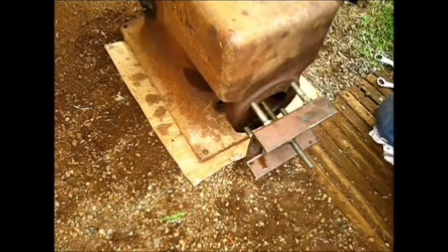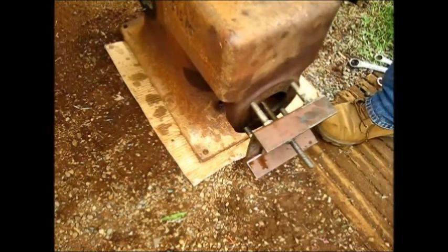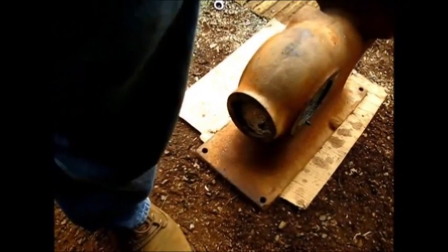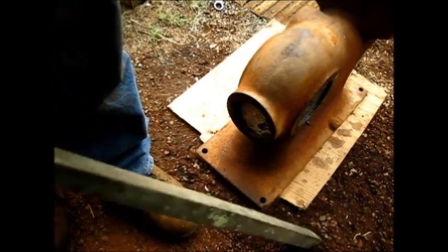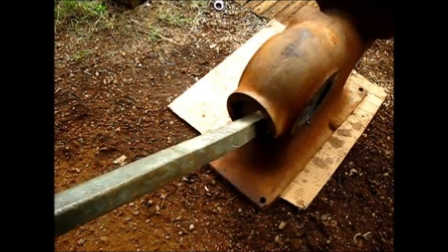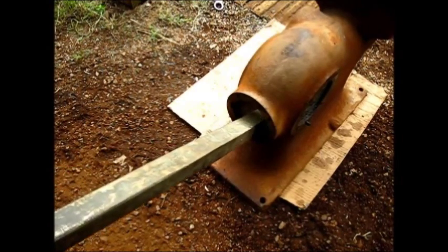Some of these should have come loose by now. The next step most people would do is put some fire to it, but I don't like to put fire to cast iron. So we're going to relieve it a different way. What I've got right there is a railroad bar — one of those pry bars. You always try that first because it's the easy way. What you want to do is poke that up in the back under and hit the back part of that washer firmly.